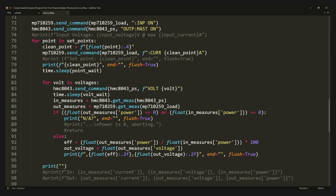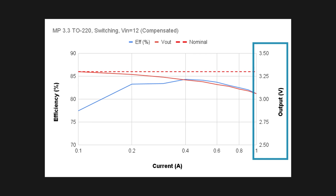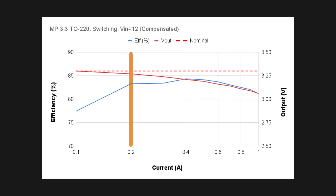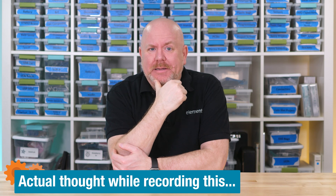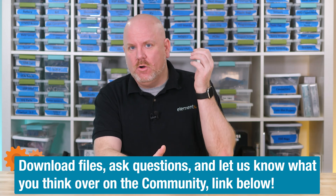Now it should go without saying, but efficiency is only one of several measurements to make on a DC to DC converter. Just as an example, I modified the efficiency script a little bit to get this graph. It has the efficiency versus current, but then I added the output voltage of the regulator on the right axis. See what happens after about 200mA? While it is very efficient, the regulator is starting to drop below the 3.3V nominal, and it doesn't seem to matter if the input is 6 or 12V. Or I measured the voltage at the wrong point. Head over to the Element 14 community to find show notes for most, if not all, of the tools I showed in this video, along with links to the other videos that I referenced. Remember that is the best place to ask questions. As always, thank you for watching — it is time for me to get back to writing inefficient code to efficiently measure efficiency on my electronics workbench.